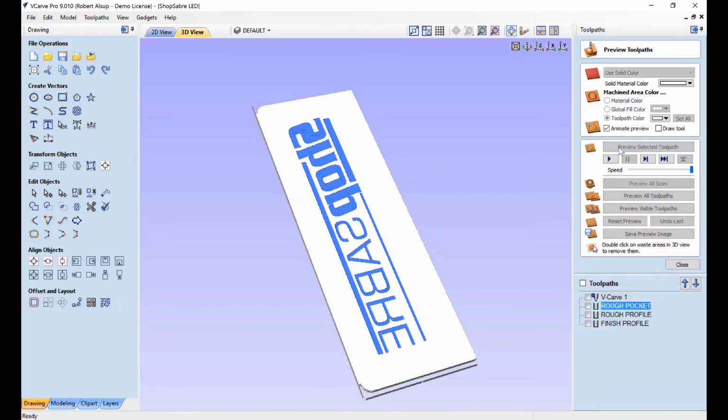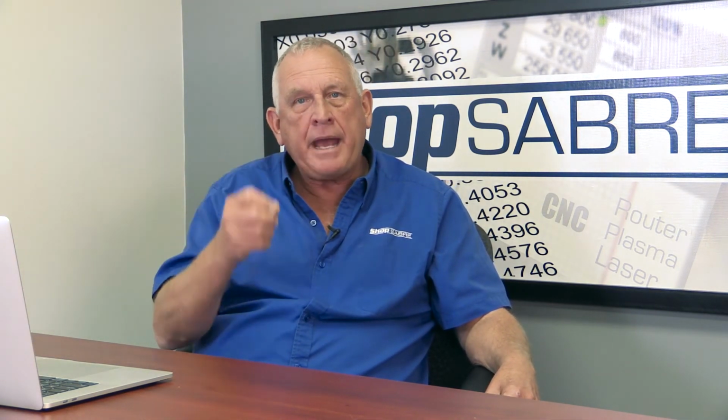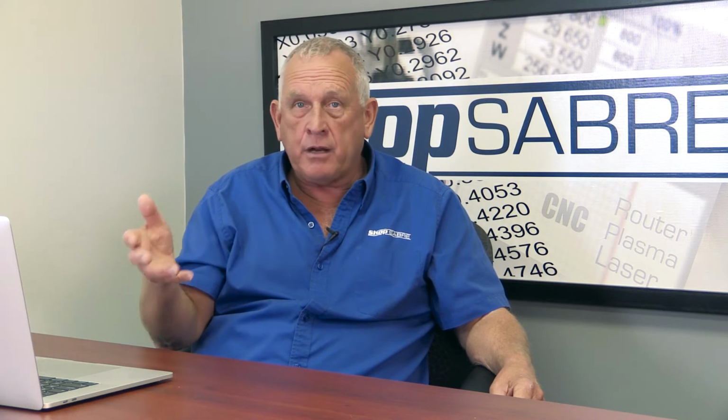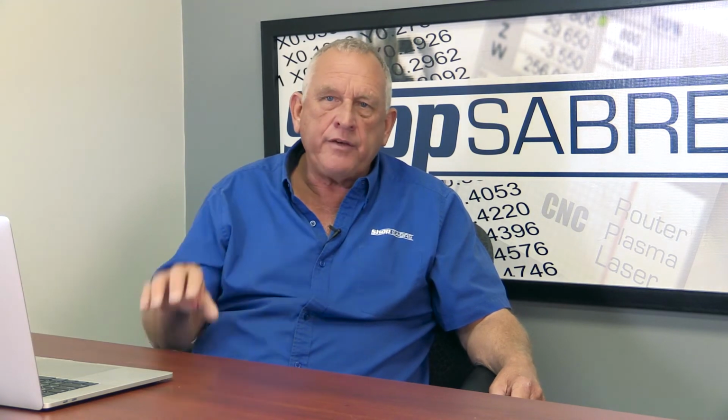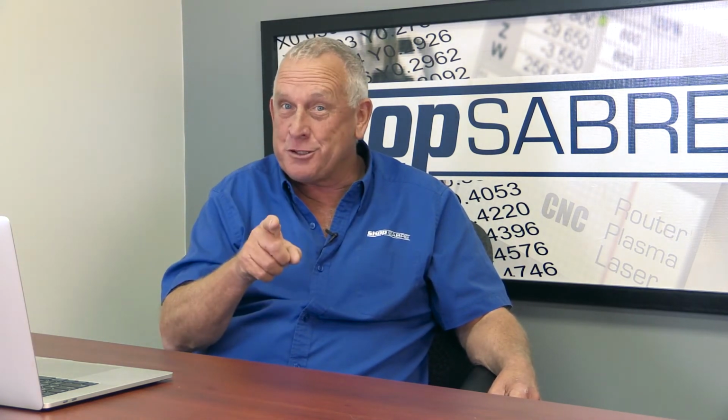Let's preview that. Okay, that's pretty good. Now, the next thing I wanted to do was actually cut the perimeter, and there's some rules for plastic. For one, typically the maximum depth of cut is about the tool diameter. So if I'm using a quarter inch bit and I'm doing half inch material, I'm going to have to go through twice. All right. So what I typically do is I make that pass and then leave about 15 thousandths. Then I do a final finishing pass, and that gives you a really, really good edge finish, and the rigidity of the machine frame really shows through on that edge.